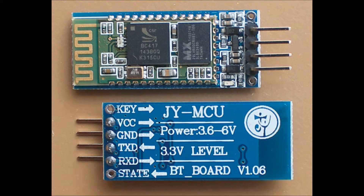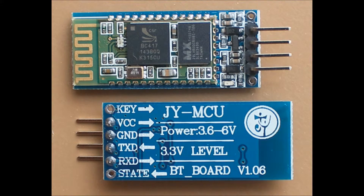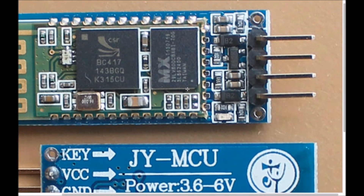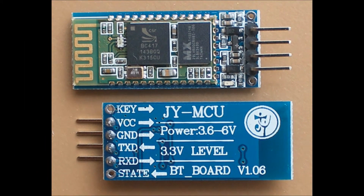On this board, you will find a small IC here, as you can see. This IC converts 5V into 3.3V, and this 3.3V goes to the main Bluetooth module on this board. So we can easily connect a 5V supply on the VCC pin. Similarly, GND goes to 0V, and RX and TX can also be used with a 5V communication level.